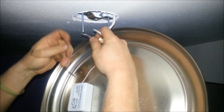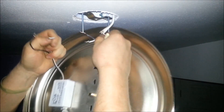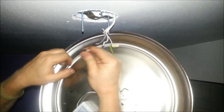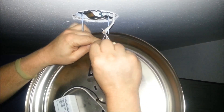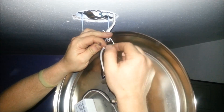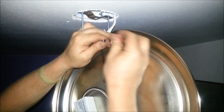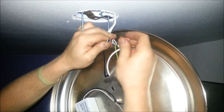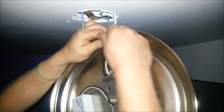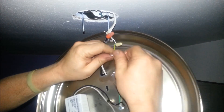I'm just going to take my line off my hot, my one off my neutral. Ground can stay because the ground is just isolating this. I'm going to stick that through here — we've got our black to black. And we'll just put it up here. This wire is braided; the wire in your house is solid. A wire-nutting trick is to actually stick the braided or stranded wire a little bit higher than the solid when you go to wire-nut them, and it gives a lot better bite.